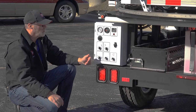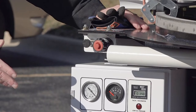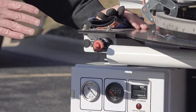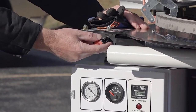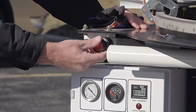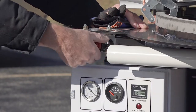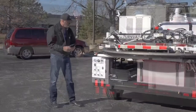Right above the control panel is the choke and the throttle. If you have a diesel version, there's no choke — instead, the digital display will show a glow plug indication and you'll want to let that light go back off before trying to start the engine. On the gas version, you have your choke and then your throttle. The throttle is a two-function throttle — you have a lock for holding its position, and you push the center button to pull the throttle out or push it back in. For fine control, rotate it to increase or decrease throttle.